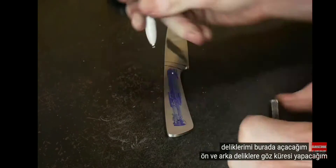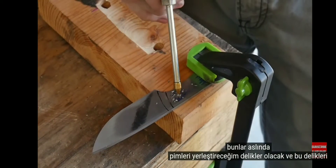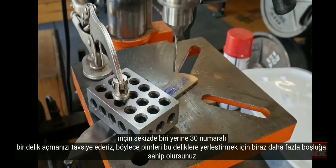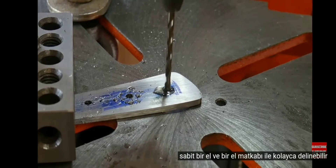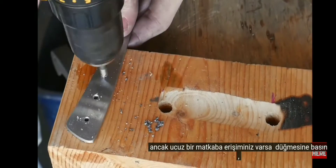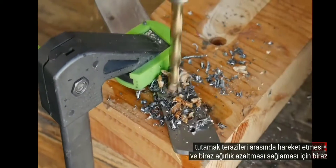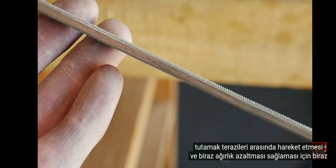I'm going to eyeball the front and rear holes — these are the holes I'll actually put pins through — and I will drill those with an eighth of an inch drill bit. If you have access to numbered bits, I would advise drilling a number 30 hole instead so you have a little more clearance for putting the pins in. These holes can easily be drilled with a hand drill, however a cheap drill press is a superior option. We'll also be drilling some additional larger holes so that our epoxy has space between the handle scales and to provide a little weight reduction.